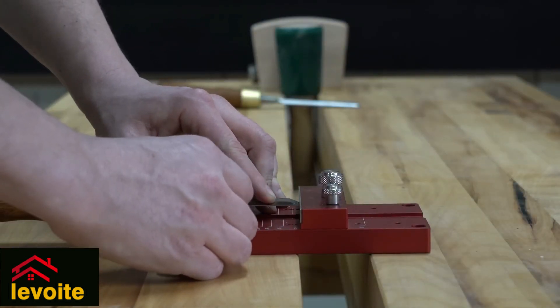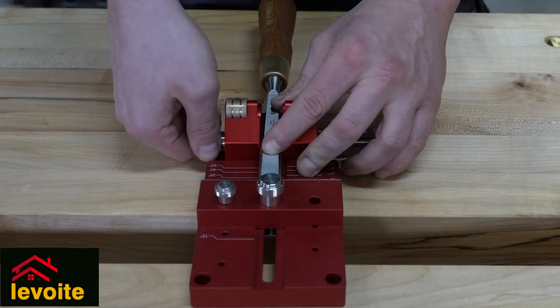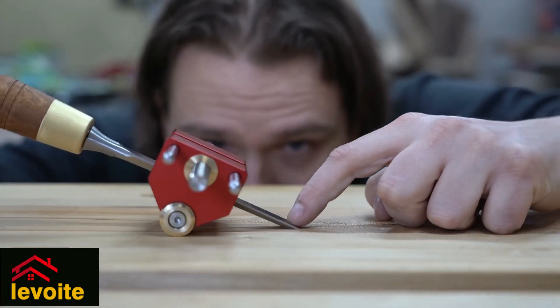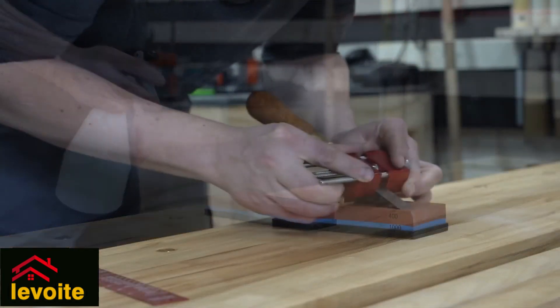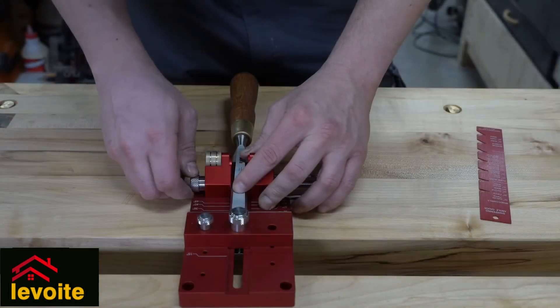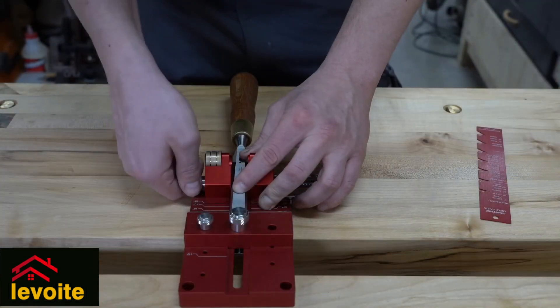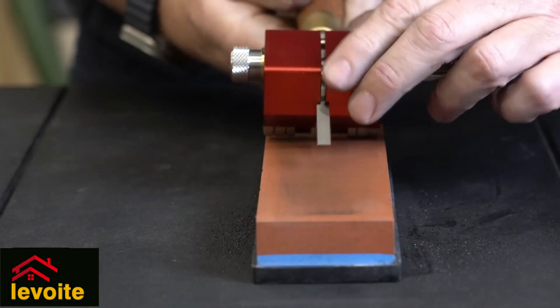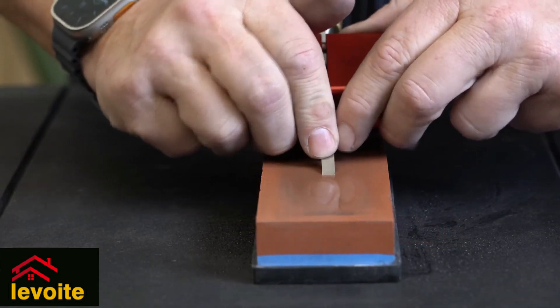This is a very straightforward method to place your chisels at the correct angle, and it works perfectly — it is repeatable and very accurate. When clamped, the chisel should be straight and secure in the honing guide. By clamping the chisels or planar blade at the side, you will always have it straight. The wheels are far apart from each other on the outside, making them very stable.